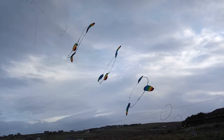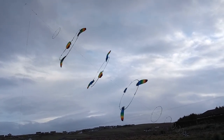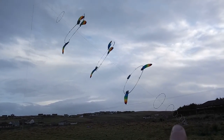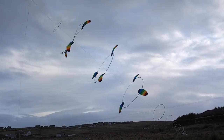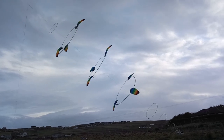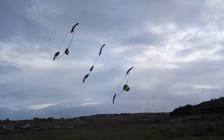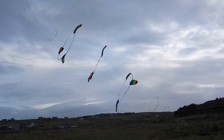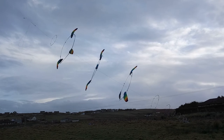Now, there's a funny thing also. When it starts stalling after a wee while, you see the deformation in the top kite, then the torsion lets go — well, the torque lets go in the generator — then it sort of springs back into life. So you see that deformation, then it'll let go in the bottom in a wee sec. There you are — it's let go, everything's sprung back up a wee bit. Speed gets up and the generator starts demanding again. In a fairly low breeze like this, that's been happening fairly consistently. That's very much a generator control thing.